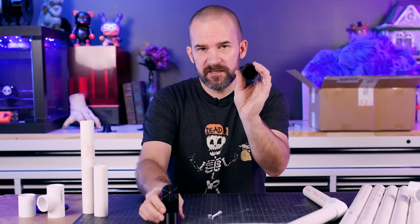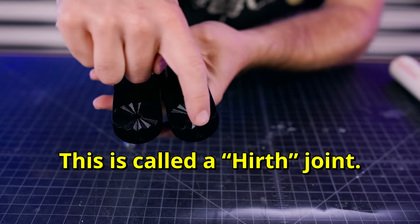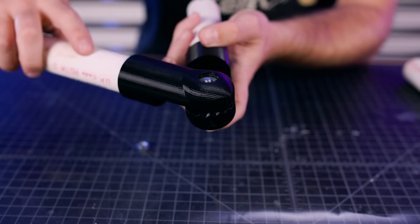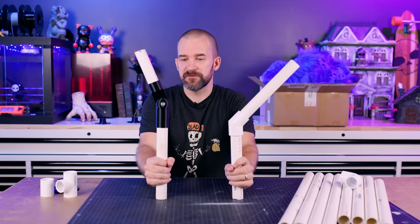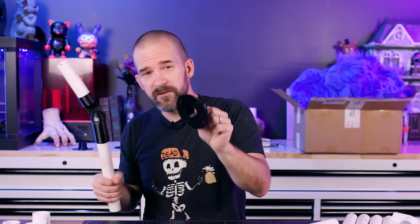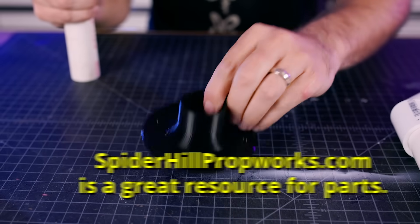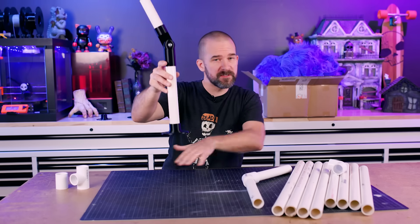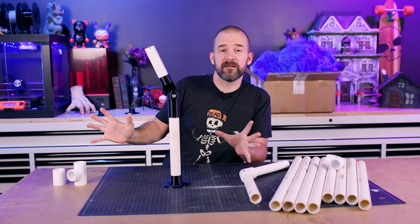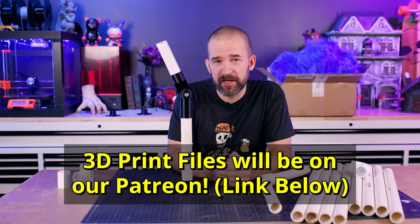There are two halves and each side has a little hole where we can put our PVC, and then a bolt goes through like this. On the inside there are little teeth that come together, and you can use this for an elbow or a knee — you've got all kinds of options for posing your character. We also designed and printed a little flange. You can get these online but they only come in metal and are super expensive, so we just made our own. You can screw it into a board or stake it into the ground and it's going to help our whole animatronic stand up. If you want to print your own adjustable joint or flange, all the files will be on our Patreon — link in the description below.